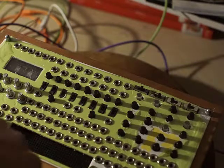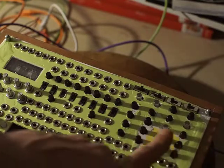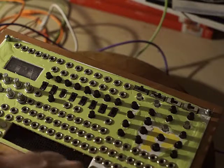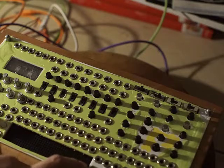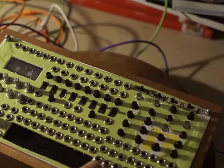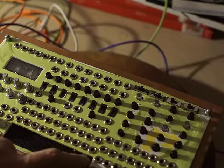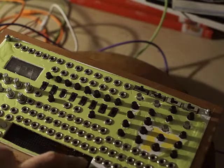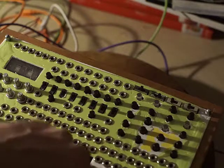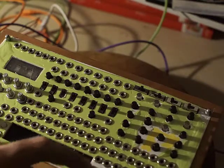Then we have the fourth section, sorry, which is 4 Monotrons. So it's an original, a Duo, and 2 Echoes. They all have modifications. Each has its own jack section and also patch bay section. The patch bay section works differently from the main section because here we have the VCC, VBIAS and ribbon keyboard input that has not been broken. So you can still play the Monotron with the keyboard input or potentiometers or triggers or whatever.